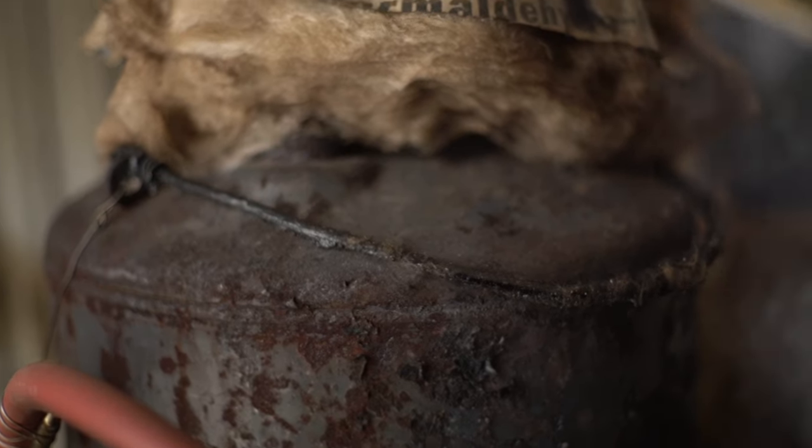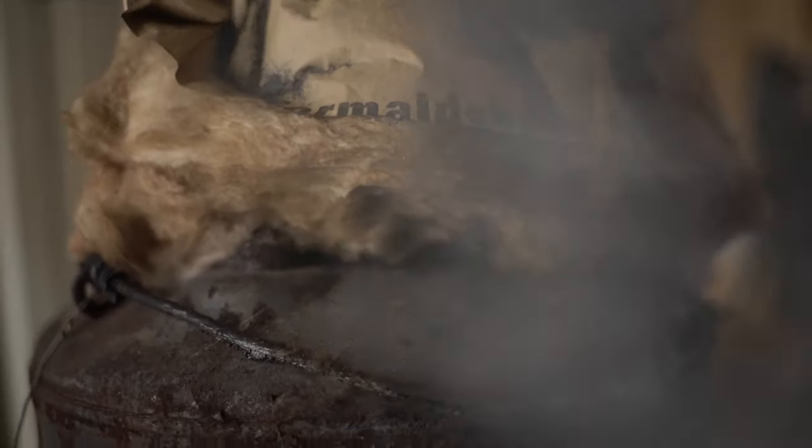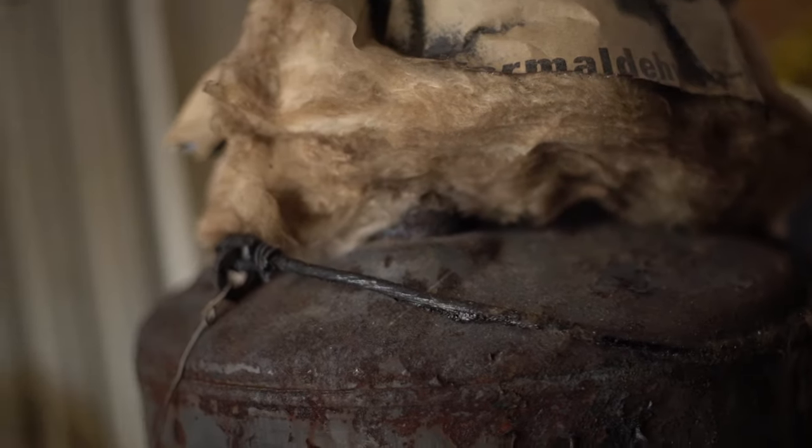We went away for Thanksgiving and I slowed the stove down just so it wouldn't freeze because we were having a cold spell. What that did was make a bunch of creosote. There was kind of a choke point right here where the stove had some creosote build up. So when I took it apart, I noticed that and decided I'm going to modify that design come summertime. So I actually just have the riser tube now — the air goes across and then up.